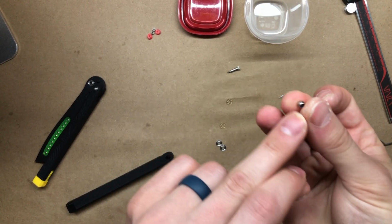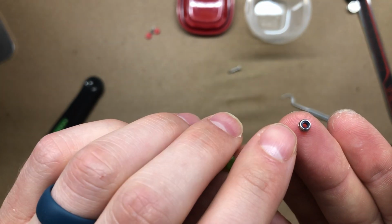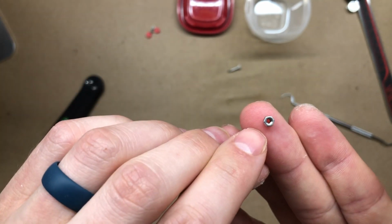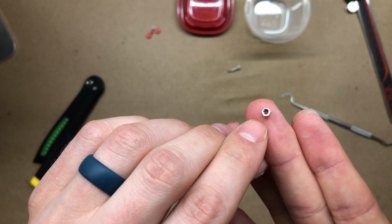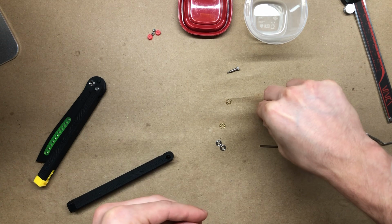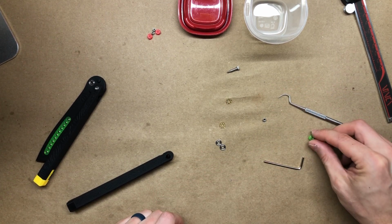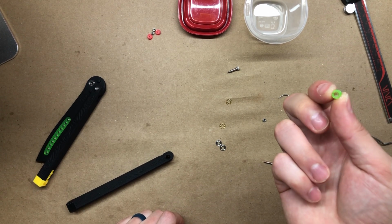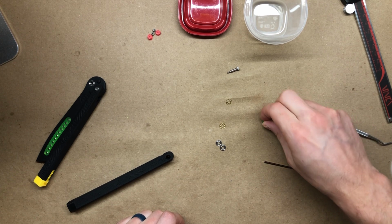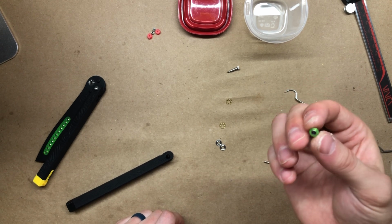And what I'll do is, you can see the lock nut has a top and a bottom. The top is narrower and it has this nylon ring, and then the bottom is wider, just has threads, no nylon ring. So I'm going to put it face down, the nylon ring pointed down so that the wider hex looking part is facing up. And I'm just going to, with the larger hole facing down here, press the hex pocket on top and it should just snap into place.